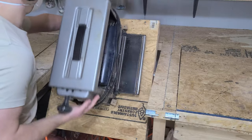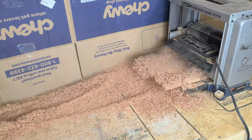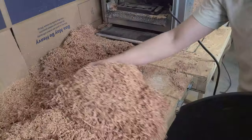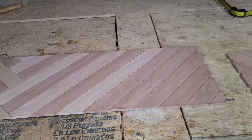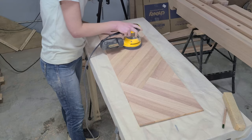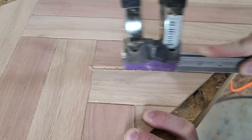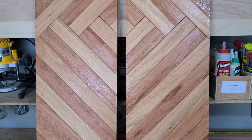Now that the mosaic panels are squared off, they're ready for the planer. We'll be running the boards through with the chamfered face down to remove the glue residue and flatten the back as we slowly plane them down to their final thickness. As we approach the final thickness, we check them against the frame slot and make a final skim to get a snug fit. Once the panels are done, we still have to sand the plain side to 80 grit and then sand both sides to 120 grit. Sanding in between the chamfered edges can be difficult, but it's a critical step so that we don't have any glue spots in our finish. We clamp down some sandpaper to a metal ruler and then use its edges to get into the groove. Don't forget to water pop between grits - it'll help the boards absorb finish more evenly and will also help you see if you missed any glue spots.